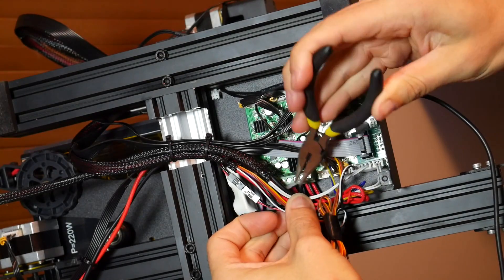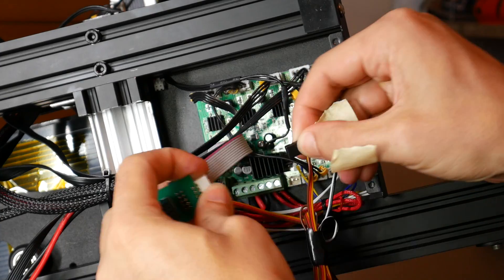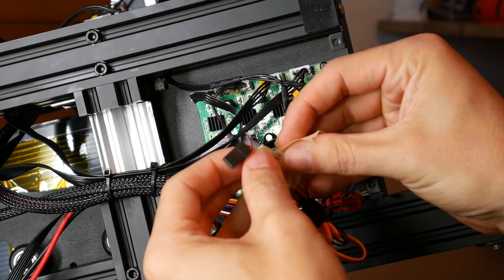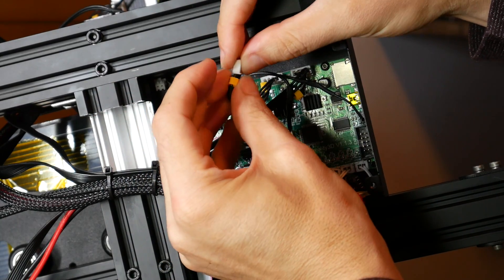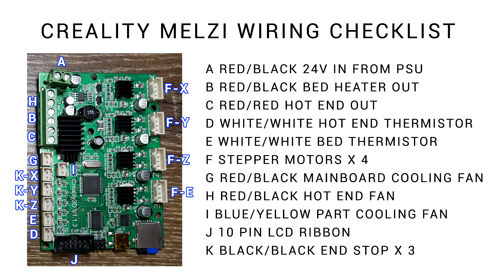Now that we've got our printed parts ready to go, it's time to disassemble the old setup and prepare our new mainboard. Start by removing all of the little bits of hot glue that stop the factory plugs from coming undone. After that, unplug everything one at a time and label them as you go with masking tape so you know what's what when it comes time to put everything back together. A fair few of the components are already labelled X, Y, Z and E so you won't need to worry about doing those. I've made up a handy diagram linked in the description — you should use it if you're unsure what the components are. A lot of the plugs look exactly the same, so trust me, you're really going to want to do this.